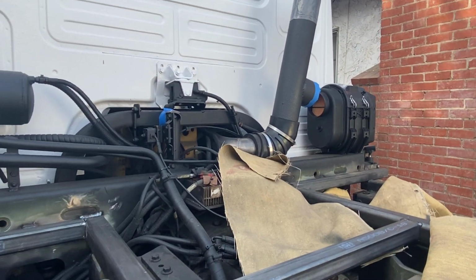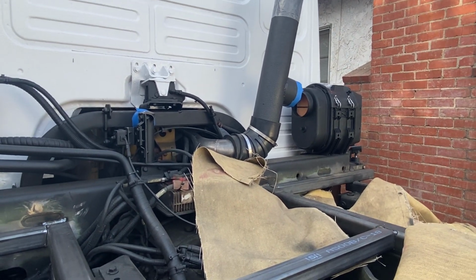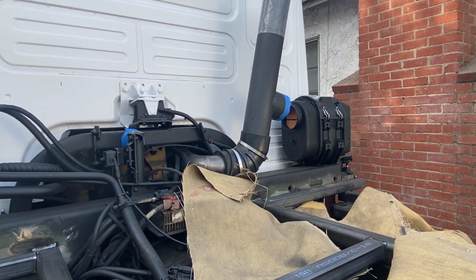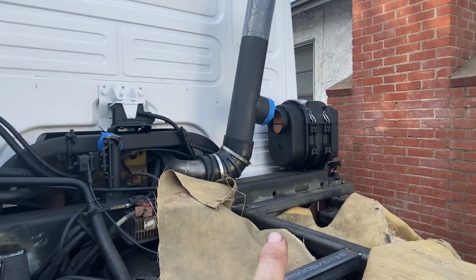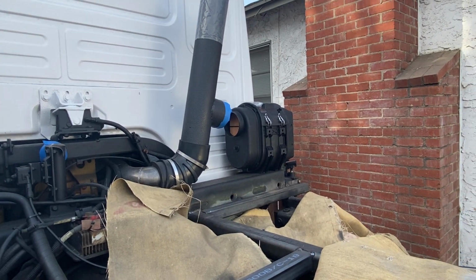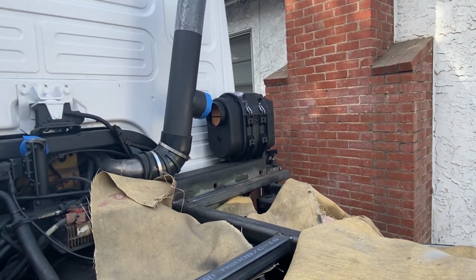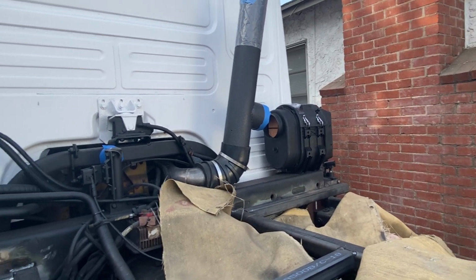Last couple of days, I worked on getting the air intake tube. I went ahead and took all the paint off the intake, and reused the stainless. I TIG welded all of that up. This looks like it's sitting wonky right now, but I got the second Donaldson filter in, it's that one right there, and I have to fab up brackets and everything to hold both of those. So I'll be working on that probably maybe Friday afternoon. That'd be a little bit of a project.